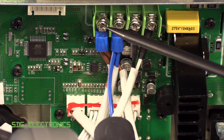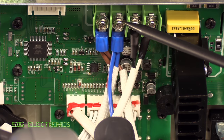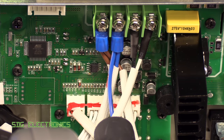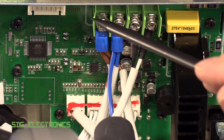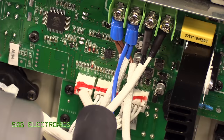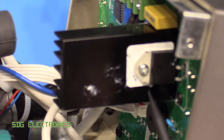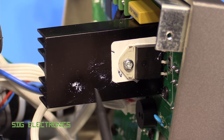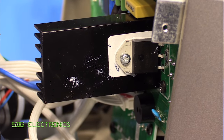We've actually got mains on the front panel, and you can see it's been tightened up a little bit extreme, pushing the plastic out of alignment. The mains are on these two terminals, and the output to the heater is on two others. There is an isolation mark in white all the way around there and around the heatsink. This is what's driving our 1300 watt heater — we've got a triac here mounted on a big heatsink, and this heatsink is soldered into the PCB to stop it ripping the triac off the board.